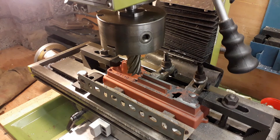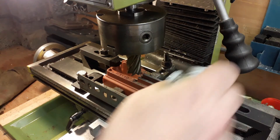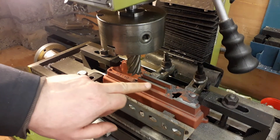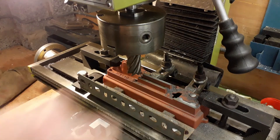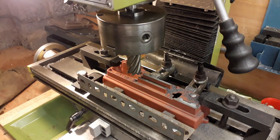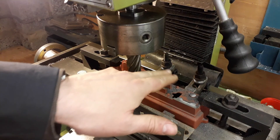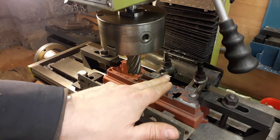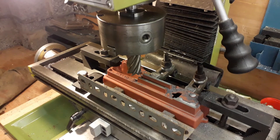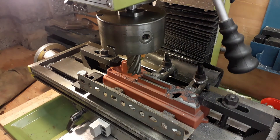There we have it — that's your two faces machined off. The scribe lines we put on are bang on the scribe lines. The finish isn't bad at all; might just clean that up a little bit with some wet-and-dry on the surface plate later on. That's your two main surfaces done. That's your critical measurement there — the 21/64ths. Make sure you get that one bang on. It doesn't matter what it is off the deck as long as those two faces are that far apart.